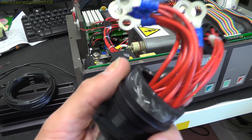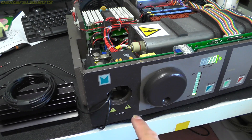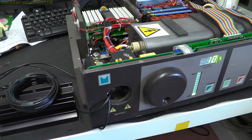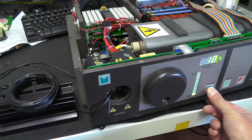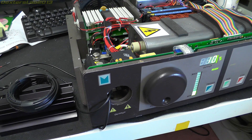I've ripped off the connector which is no longer needed and I've just wired in a coil here — you can see that just here. I've got this charged up to 10%... if I charge it, it's now ready, and if I trigger it, hopefully you can hear that. I've just got it set on a bit of aluminium just to give it something to react against. I don't want to turn it up in my lab because I've got computers and all sorts of things here, and I don't want any risk of damaging them with stray magnetic fields.